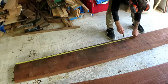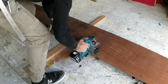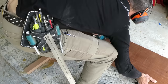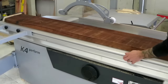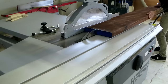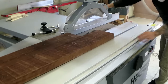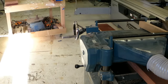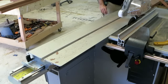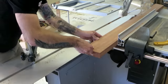The first job is to sort through the timber and work out how to break it down. With the new table saw, the massive sliding table makes it super easy to straighten out a board. Just run it along the sliding table, run it along the fence, and you've got a couple of straight boards. That made it easier to thickness up the timber, and then once it was the right thickness, I could square up the edges with the sliding table and the fence. Really fast way to machine out timber.